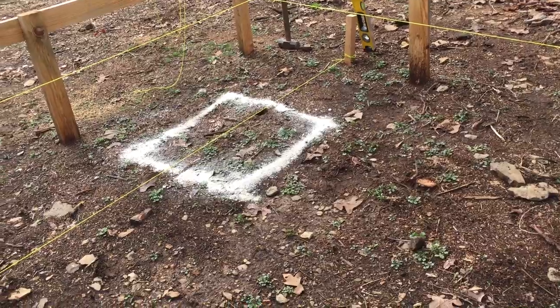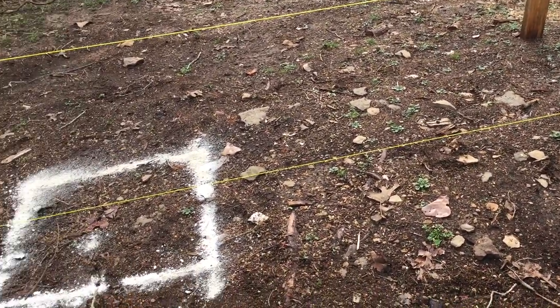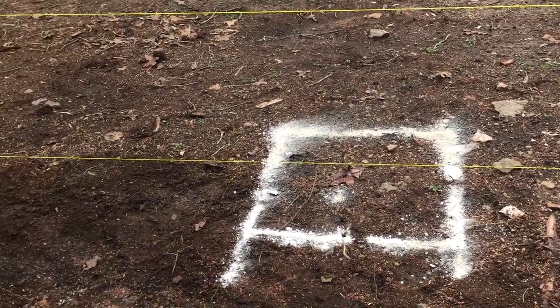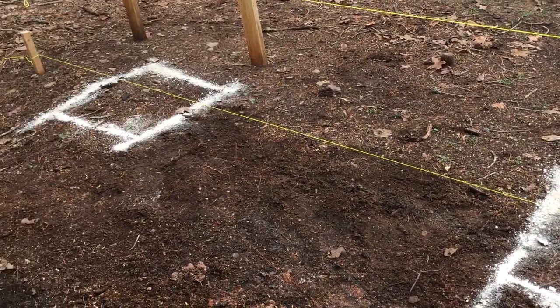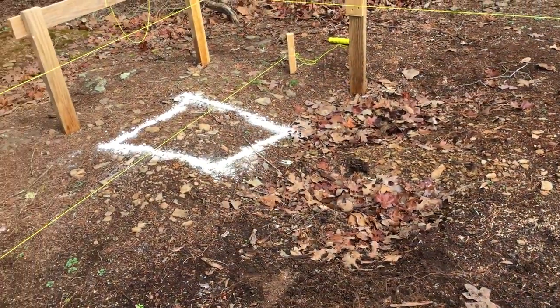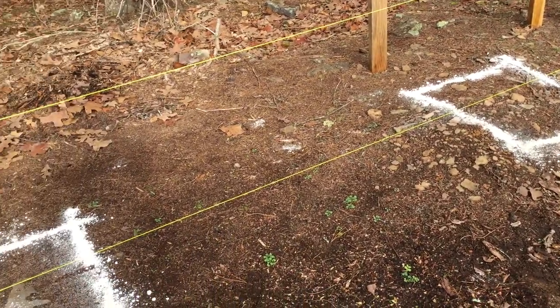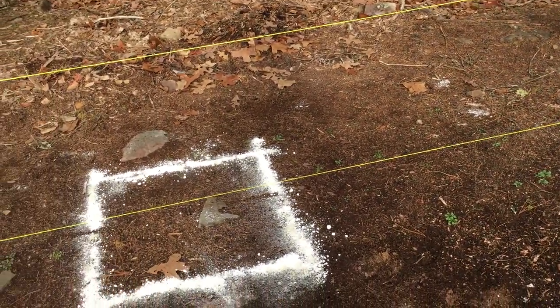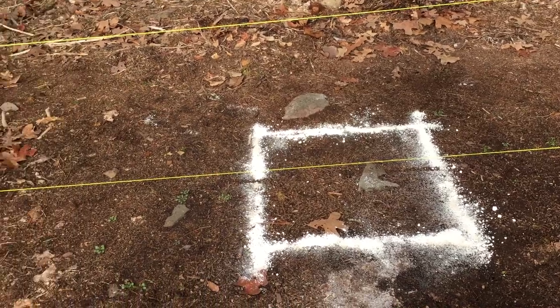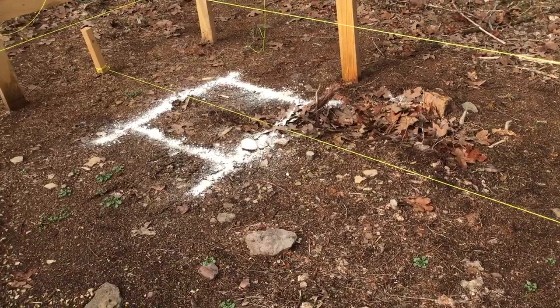I've got the piers marked on the ground with the lime, like I did on the smokehouse when I dug the footing for it. I just put lime on the ground that will give me an outline to actually dig to. We're going to dig these footings probably 14, 16 inches deep. They're 2 foot square, 2x2s, and we'll put steel in them, do the termite treatment on it.